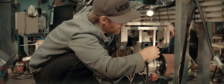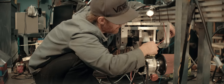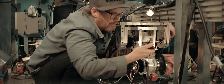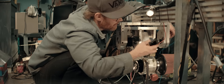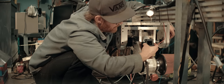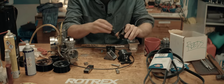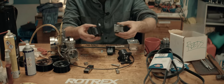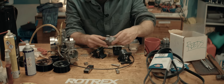With a reed, it would be best to sink it into the case to take up some volume. That would mean taking the cases apart and machining them for this reed, which is not meant to be there when things are working. I'm gonna use an adapter and fit the reed on the outside like this. I was looking through my old parts trying to find something that could work. Some kind of a reed adapter. I've run quite a few reed adapters earlier on various moped builds.